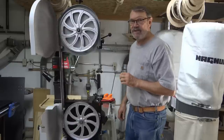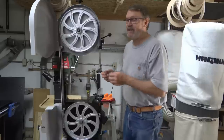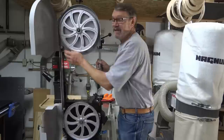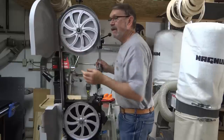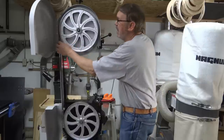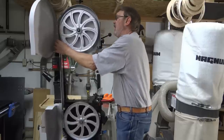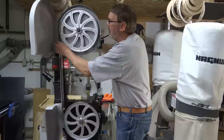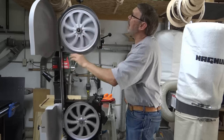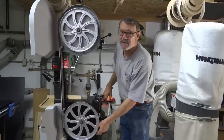Now the next thing you want to set is the tension. This is a judgmental thing. I've had people tell me you need to take a fish scale and get a certain number of pounds or grams before it flexes, but that doesn't work for me — I just go by feel. I get it until it feels right to me without getting too tight. I do not use the scale that's on the back; I don't trust it at all. Now when I turn it, it's actually riding right on the center where I want it to be. The bottom does not matter too much as long as the entire blade is on the wheel — you don't want it coming forward and being off, or going toward the back and falling off.